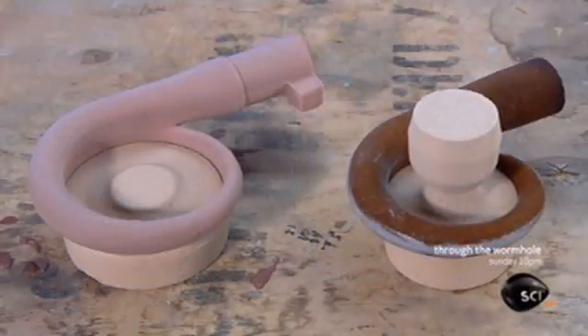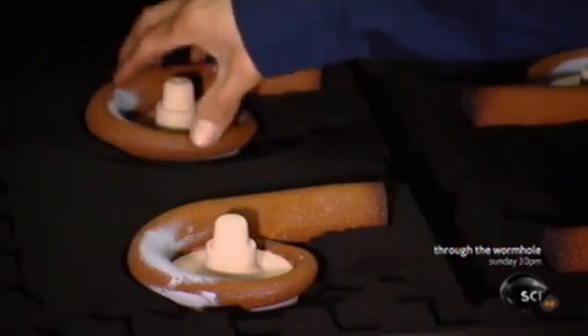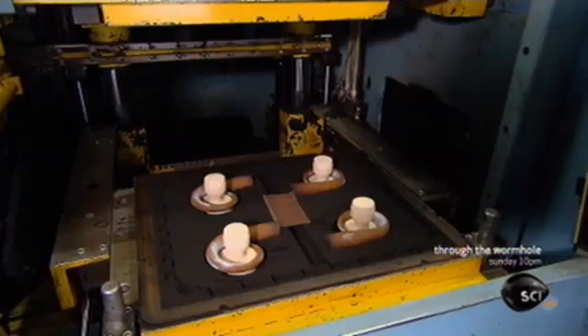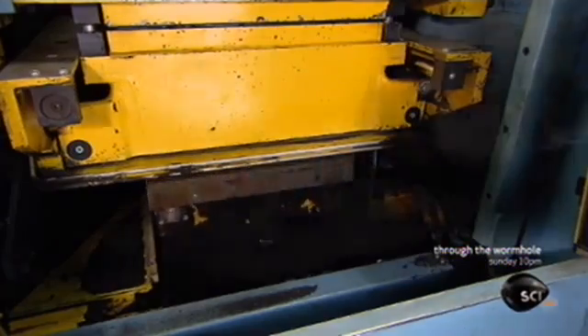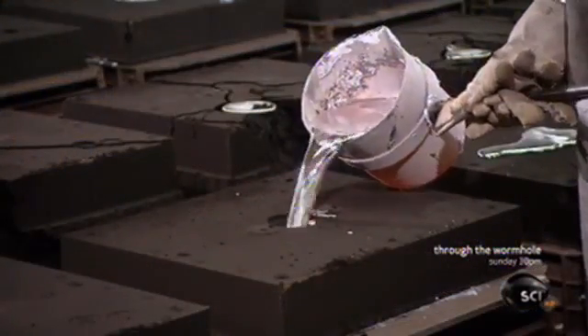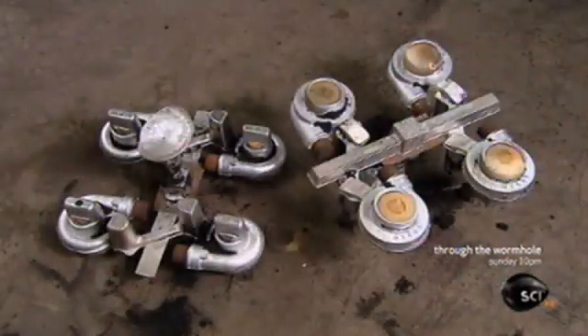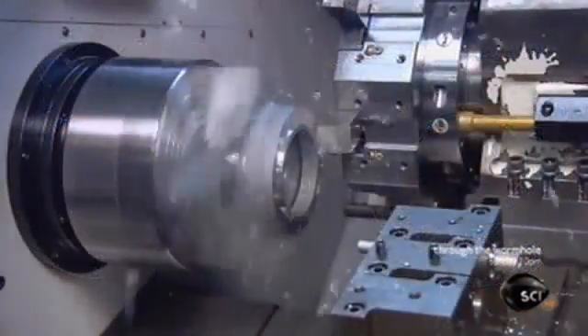These snail-shaped sand cores are now ready for casting. He places them in a mold also made of hardened sand. Machinery lifts the bottom half of the mold to the top half, essentially closing it. He pours molten aluminum into it, and it flows into the spaces between the cores and outer mold. The aluminum solidifies in a minute and the molds tumble onto a conveyor, revealing the cast turbocharger parts connected by hardened flow lines.